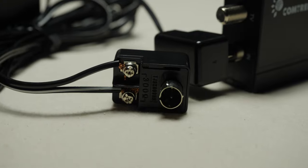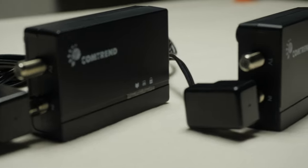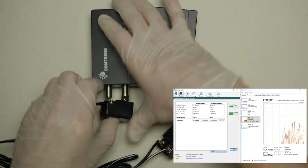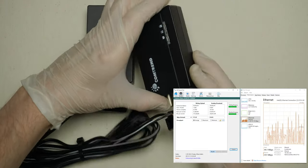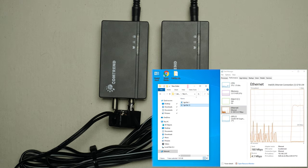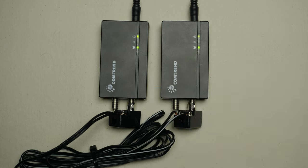For the third testing scenario, I had a zip-tied bunch of 6 to 8 feet of 18-gauge speaker wire that I clamped into a 300 to 75-ohm balun. That setup got an average of 541 Mbps read and 169 write, a max of 588 Mbps read and 193 write, and minimums of 232 and 26. The 1GB file sustained maxes of 694 write and 629 read. I have no idea if impedance had anything to do with the gigantic crater for a minimum, but I wouldn't be surprised if it did — and I say that with no formal scientific background whatsoever.